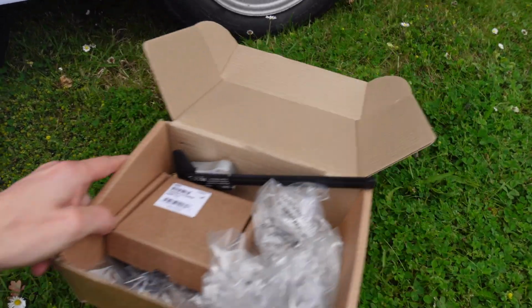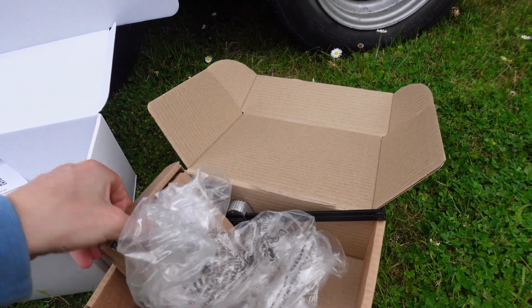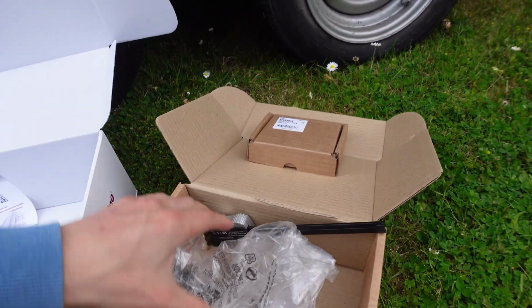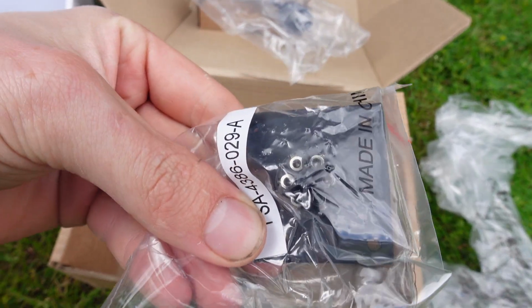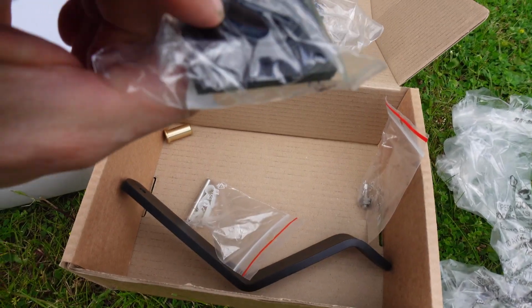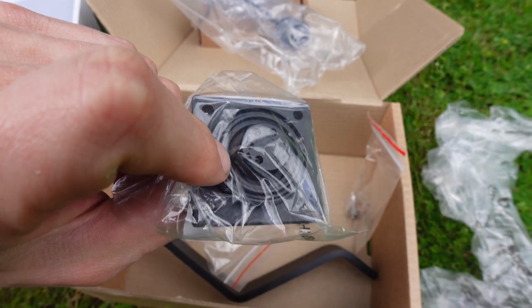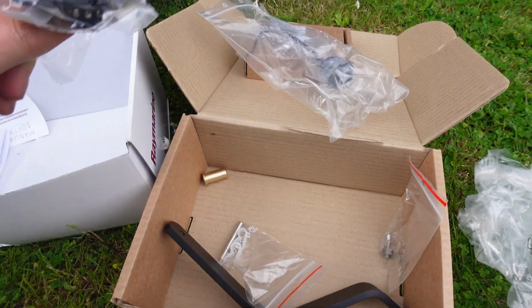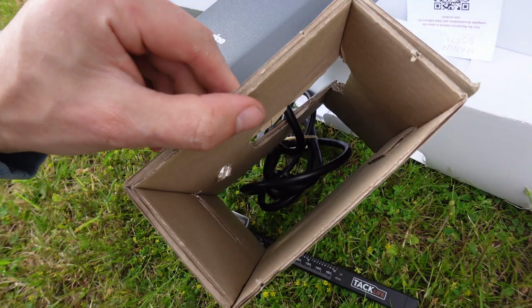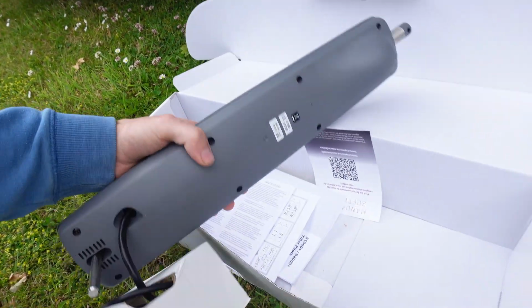So yeah, in the kit it comes with this, you get the power connectors, and then also in this box of bits over here, I've been rummaging through this. I picked up an extension because I might need that. We've got the cap for the electrical socket, so you can see there, got the little connectors in the back, to hook up your Raymarine gear and things like that on the NMEA network, SeaTalk. So yeah, and that'll just plug up to the plug that comes attached already to the little tiller pilot.